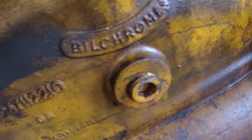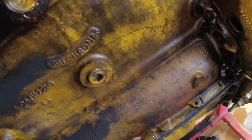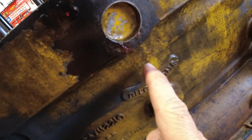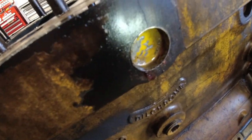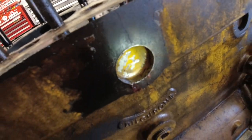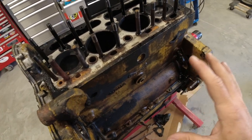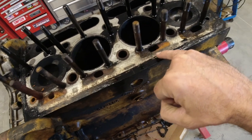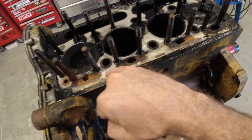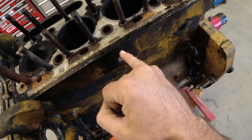When I was doing the pressure washing, I did notice this little crack right here - I was planning on simply brazing it, because this was holding pressure just fine on our coolant side. But there is also a very small crack that goes up to the freeze plug, and then another one heading down. If this were an easy engine to remove, I would probably weld right up through the channel - cut a groove, get the cast iron super hot, and weld that.